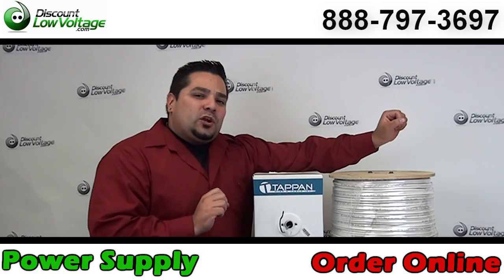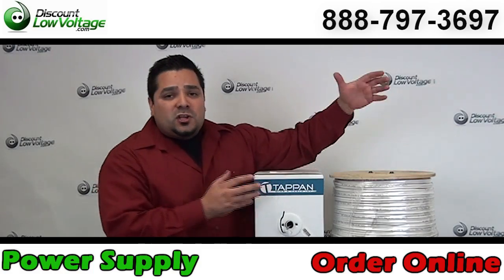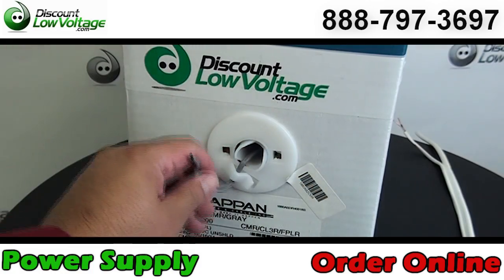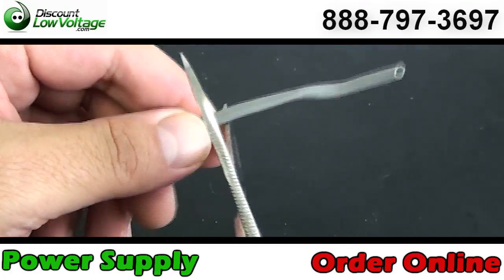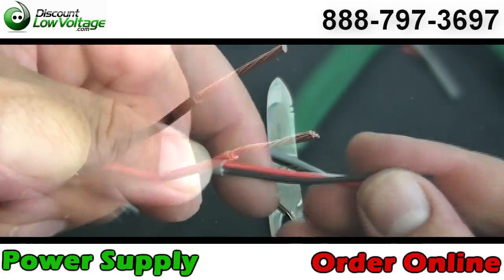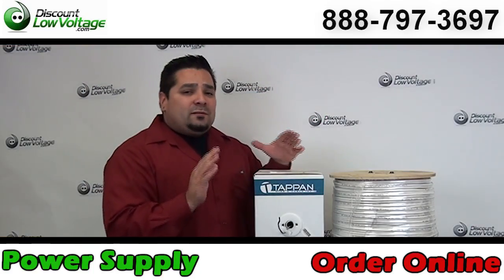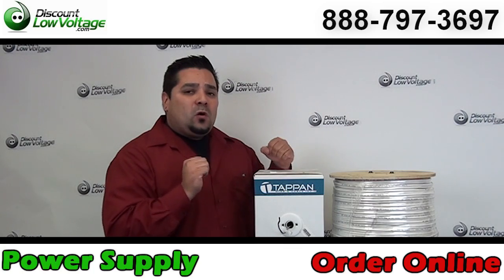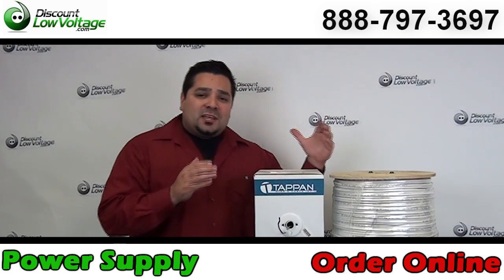You might need to run your power separately. If you go that route, what's commonly installed is the 18-2 by itself. Run that for your power to a separate location. You're going to run a separate RG59 cable for your signal back to the DVR. So you're going to have 2 separate cables, 2 separate home runs for that type of installation, that type of setup.